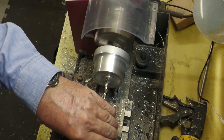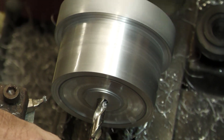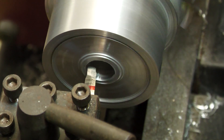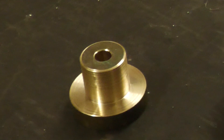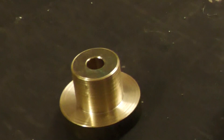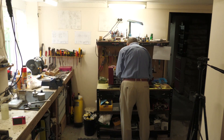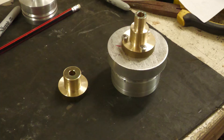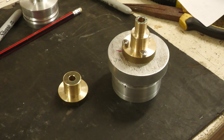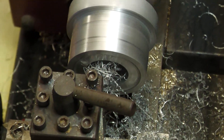That diameter was still 5mm too big for the chuck to grab. We drilled out the center hole, but both Dad and I knew the plastic adapter couldn't support the part when we started enlarging the hole. So the only option was to make a new adapter out of brass. After carefully choosing the stock and spending 30 minutes machining it, we realized it was 2mm under what we needed and had to start again. The second adapter was finally the right size, with holes matching those already in the aluminium part.